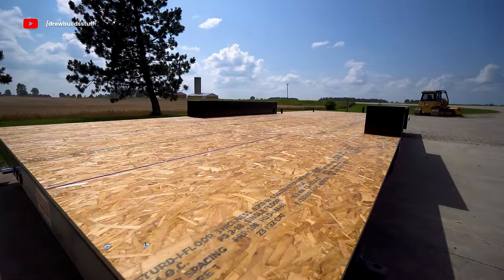Once the beam was mounted, I measured up from the floor to get the exact height of the top of the beam so that I could cut another piece that would extend upwards and meet the exact same height as those blocks we put at the two ends that support the ridge beam. This is just another step to making that ridge beam perfectly level. Then I set this second chunk of beam in place, making sure it was centered, and used some more 3/8 inch lag bolts.